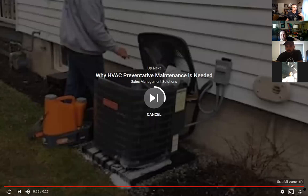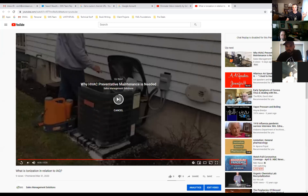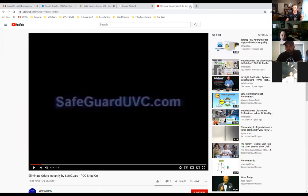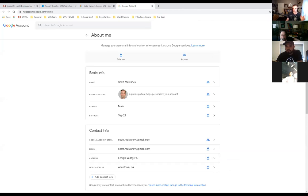There are some people who are anti-UV. If someone is sensitive to UV — which is rare — they might choose ionization at minimum to start improving indoor air quality. Ionization is definitely less expensive than UV as a solution since there are no UV lamps involved. One of our in-duct solutions aligns with ASHRAE standards and actually has both UV and ionization technology included in it.